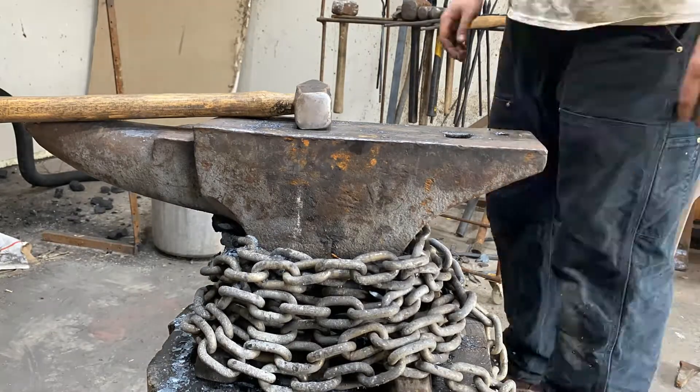I've got the final shape here as far as forging goes. As you can see, it bends up a little bit and the actual blade itself is curved. I'm going to let this cool down and then take it over to the grinder to get it all cleaned up — especially here in the back. I want to make that a little more flat, and then obviously sharpen the blade and clean up the exact dimensions of the sides. I'll show you guys the final product.